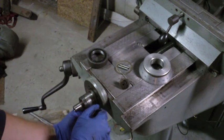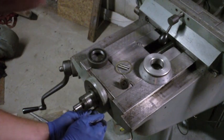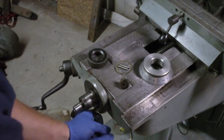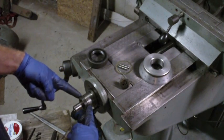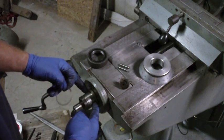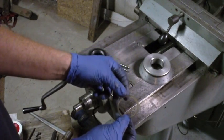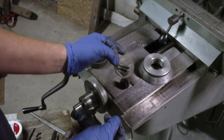The other reason I'm going to take that control off on the knee there, just the dial, is I recall that on this outer shaft here for the knee, there were two plastic washers on the back and one plastic washer on the front. This one has just one plastic washer that was on the front and there was no plastic washer on the back. I don't believe, because these are just plastic or nylon, I don't believe these serve any critical dimensional purpose like a shim.